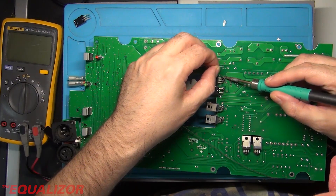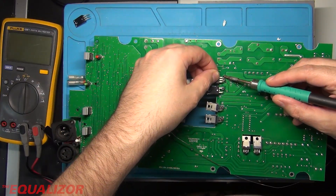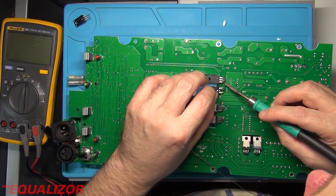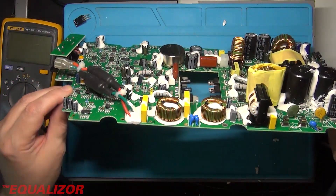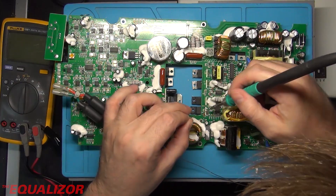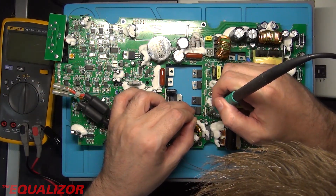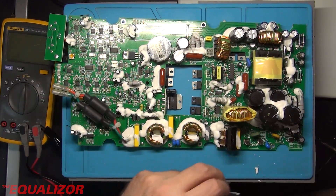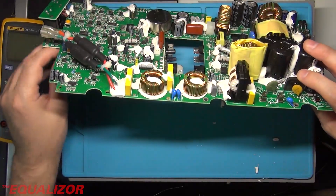Do a bit of soldering on this side to get it in. Need to make sure they're reasonably level because they're going on a heat sink. Let's solder that on there — that seems pretty good. We'll do this one on this side, flip it over — looks pretty level to me. We'll just finish them off, and then we're going to put the bridge rectifier back on.